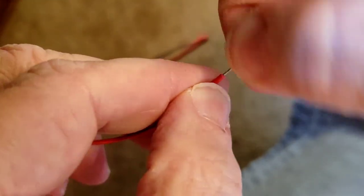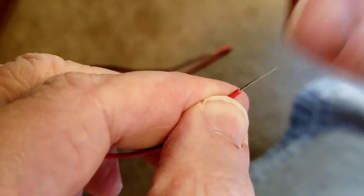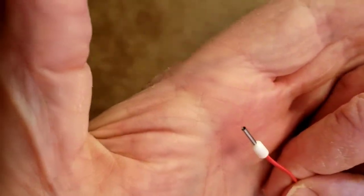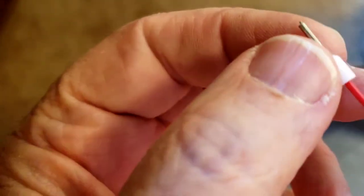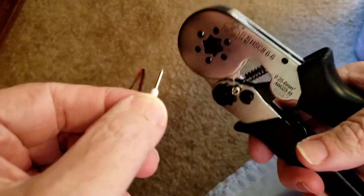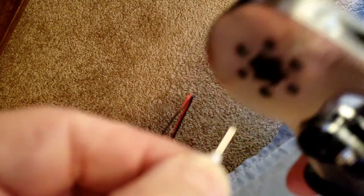Give her a twist just about like this. Grab one of the ferrules and put it in there just like this. There's the ferrule and there's the wire sticking out — it's definitely up inside the jacket of the ferrule. Then take the tool, open it like that, bring it down, and I'll show you.